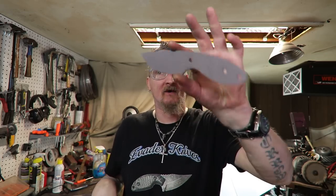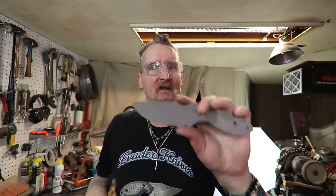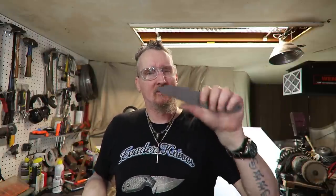Last night I went ahead and painted this old one up with anti-scale. These two are 52100 and 80CRV. If you watch the previous video, you'll see you don't really need the anti-scale when there's chromium in it. I'm doing something a little different — not going to do all the slow motion, at least not in this part. Tomorrow is 58 degrees so I'm going to try to do the oven heat treating and the outside heat treating all in one video. That way we can compare O1 in the oven versus O1 from a torch heat treating — knocking off two birds with one stone.